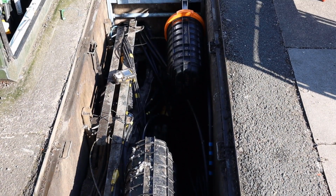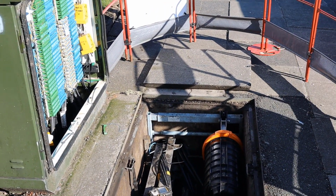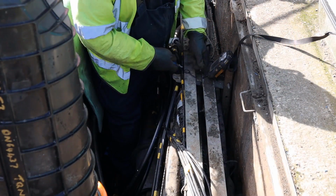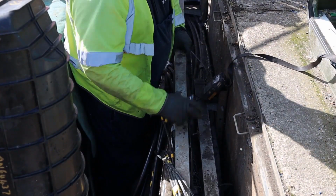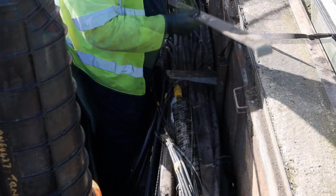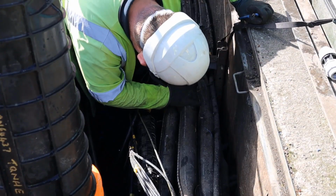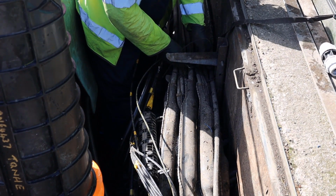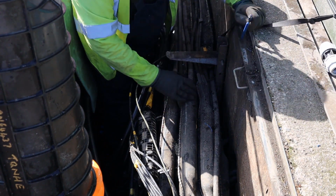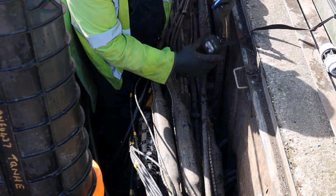Once agreed the work can take place, you now need to check there's enough slack in the joint box to facilitate the rehanging of the internal components. This amount can vary with each situation. If there isn't enough slack in the first joint box, check further down the cable route. If there isn't enough slack overall, then the reshell must not proceed, and the planner must be contacted and informed, and neither the civils nor the jointer assist can proceed.